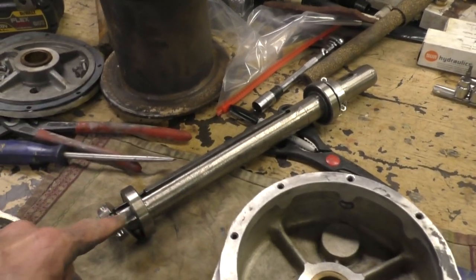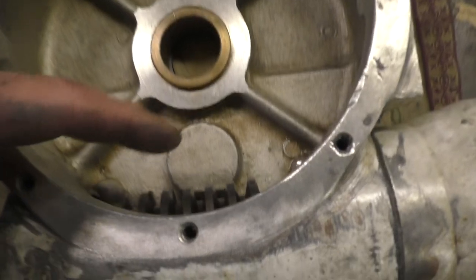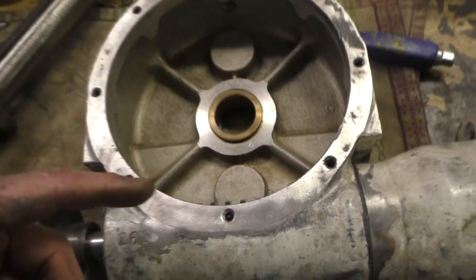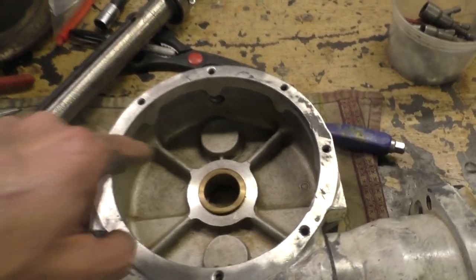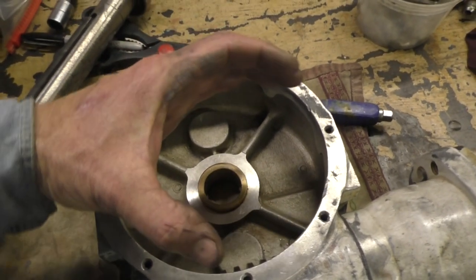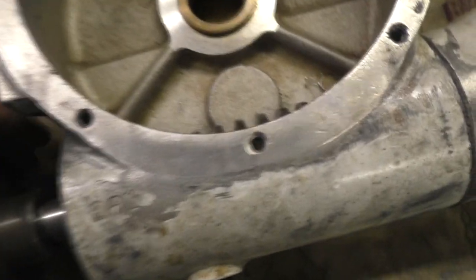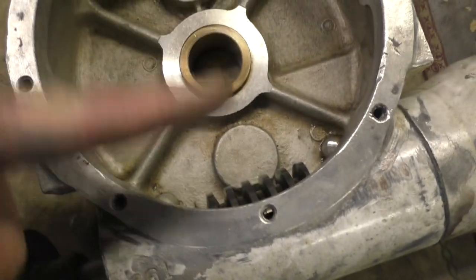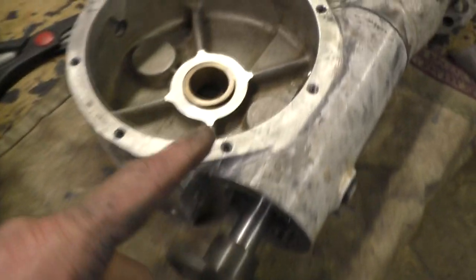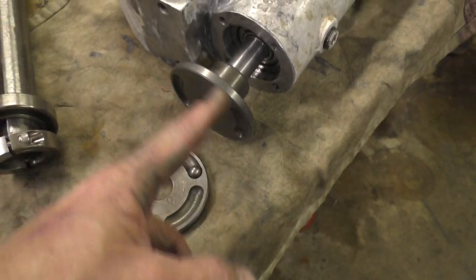Think about that. There's a shaft that goes through that, comes in through the back. There's a gear here, meshes into the worm screw here. So basically, this is the same orientation as that spool. So the force is this way, right? So if we're pulling the cable in, we're doing like this, and that screw would have to be rotating, looking at it from this way, clockwise, to get that motion, right? So we know that this is spinning like this.